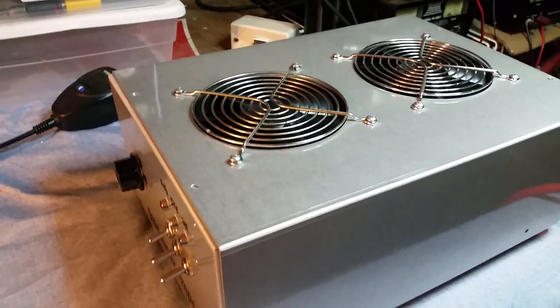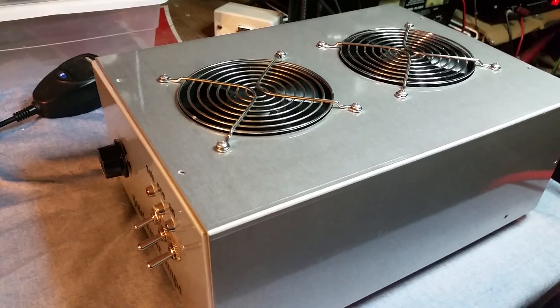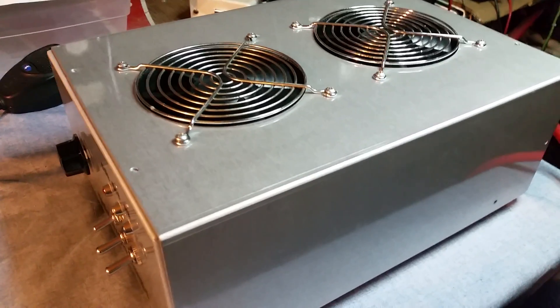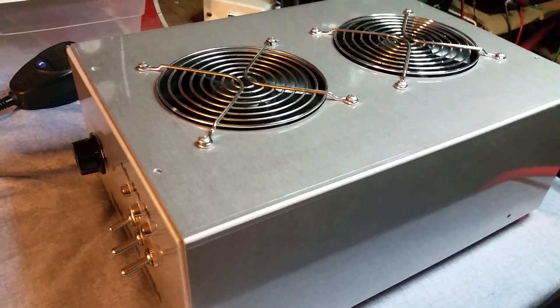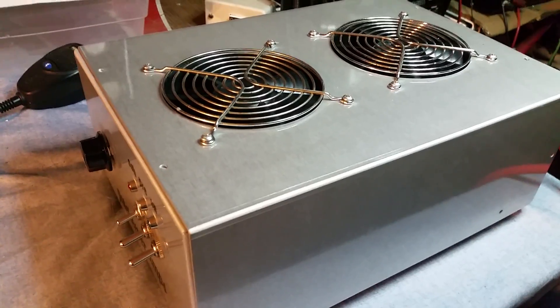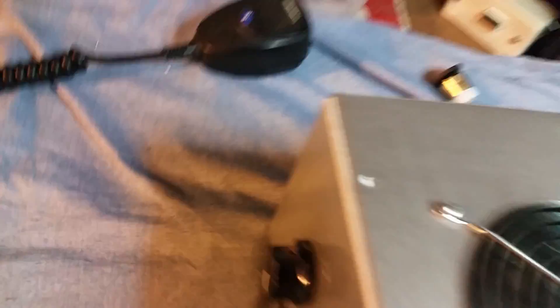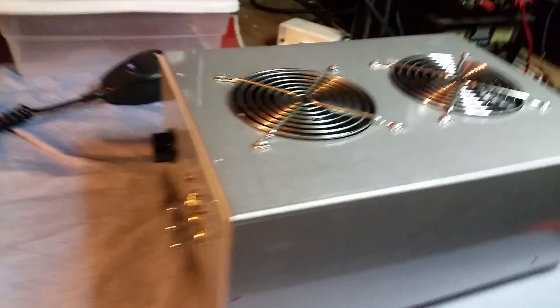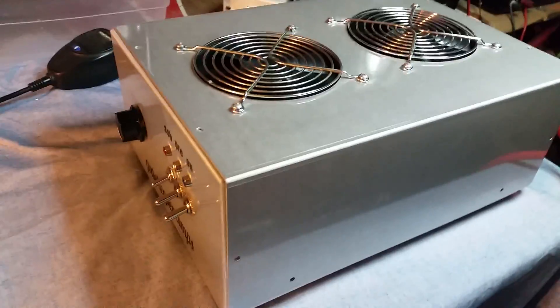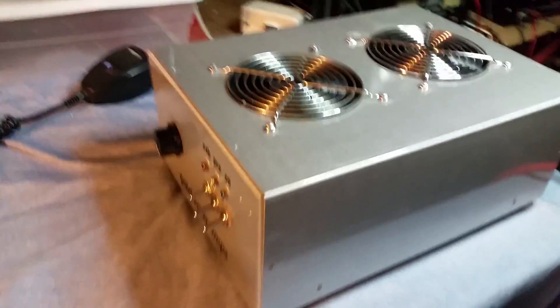Let's see what she's going to give you. We're just going to go ahead and show you the max output of it — shooting about eight watts RMS. I will show you the input tune. I'll hook up the bench radio and show you the input tune. The input tune is absolutely perfect — virtually no reflected power coming back from the input of the amp.